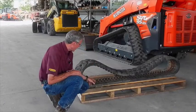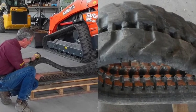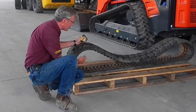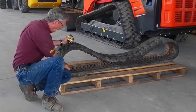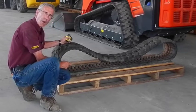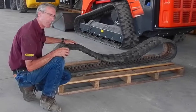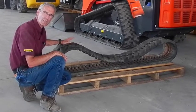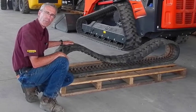On the inner portion here you can see the steel bars a little better because the rollers were actually riding on the steel. In the mini excavator you see that more often than you do on a skid loader. These are the bars that generally start tearing loose and coming out on a skid loader — the rubber will crack and get distorted, and eventually the bar will tear loose. This one also has some cuts and gouges but was not really in need of replacement at this time. This could possibly make a good spare track for somebody to get them out of a bind.